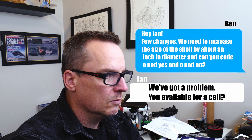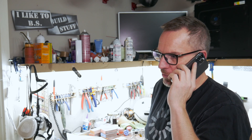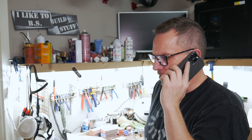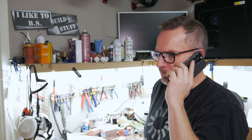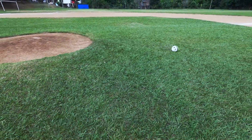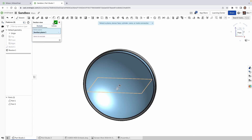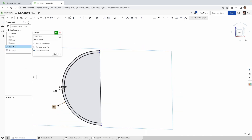I'm about to disappoint one of the most famous Hollywood A-listers on the planet. The original spec for the robot was pretty simple. What I've not taken into account was having him nod yes and no, and also the size of a real volleyball might be too small to look good on camera. The torque the motors can put out is good, but when you increase the diameter of the ball, the force required to move it increases. The motors are capable of five inch-pounds of torque. Now every inch you increase the diameter, the less force it can put to the road and forward motion. I've made a rule in anything I've ever built for any special effect or prop: the motor has to be at least twice as powerful as required. So when we spec'd these out, we made sure they were twice as strong as they needed to be. My prayer is that's going to be enough to actually work in this circumstance, and I'm starting to wonder if it is.